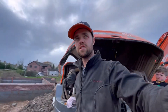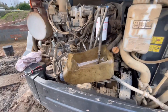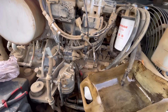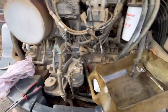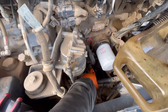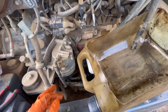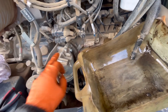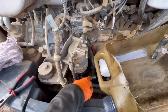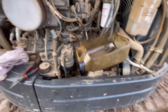It's Sunday afternoon. I've got this eight and a half tonner — if you remember from Thursday's video I mentioned it, it was alright on Friday so we never came in. It's conked out, he's dragged it from over there to here and it just keeps cutting out. The ignition is on, the electric lift pump seems to be pumping or at least vibrating, but as you can see there's no fuel at the feed into the injection pump, so I've got a fuel blockage. We'll see if it's from the tank into this filter or from this filter head into the lift pump — should be fairly straightforward.